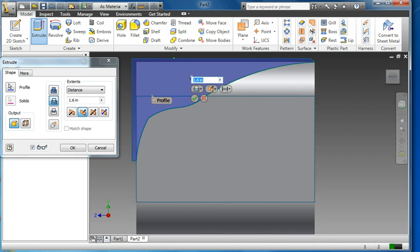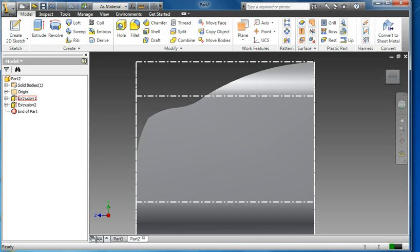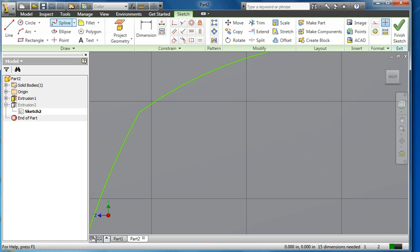I'm going to cut it back. The width of that is 3.17, and I'm seeing that I got a little funky point here that I may want to go back and edit my sketch and fix that. So I'm going to actually just do it real quick, edit the sketch, and at this point what I do to fix that is just on either side of that little point, I'll just make it just a real tiny little arc, and then I'm going to trim that point away.